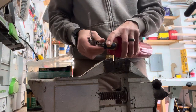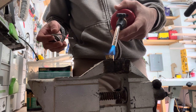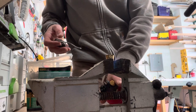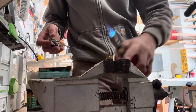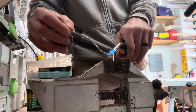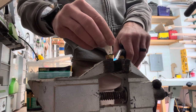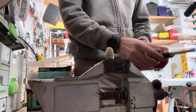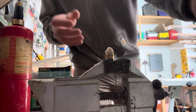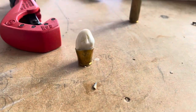I'm going to heat this brass up and then drop a bunch of solder in there until it's basically full to the top, and then push that ivory in there and let it cool. Make sure I get it all the way around so that it sticks on every side. Looks like it's working. Looks like just the right amount of solder — tighter than a tooth in my mouth. Just going to let that cool and get the other one going.